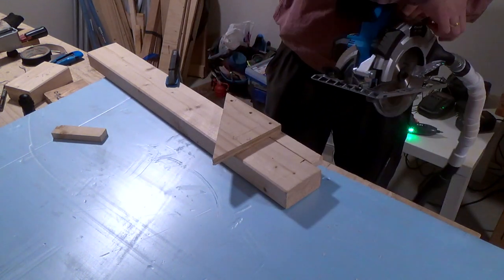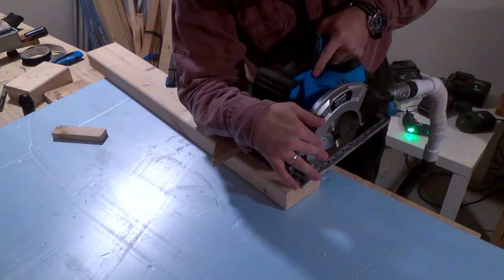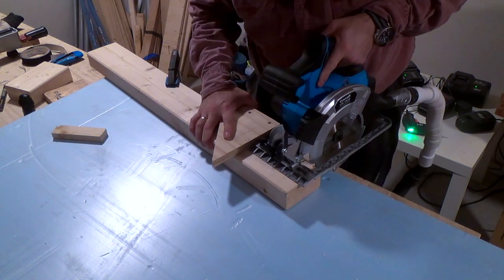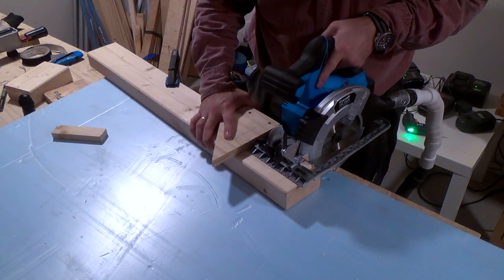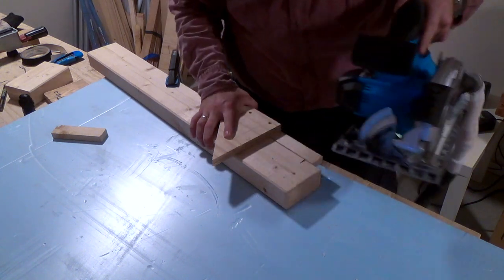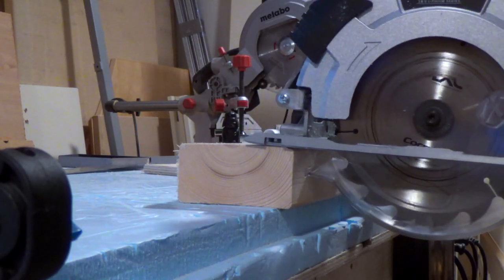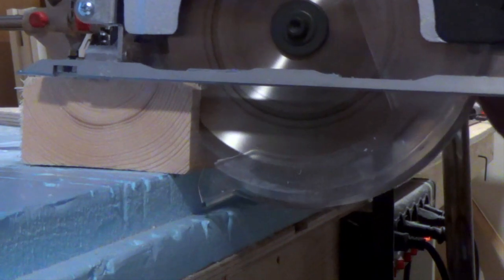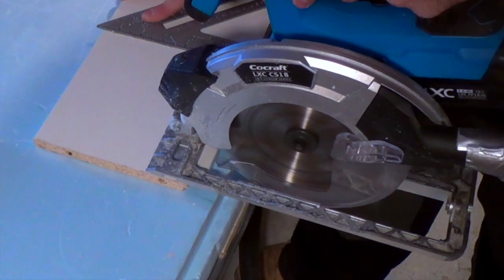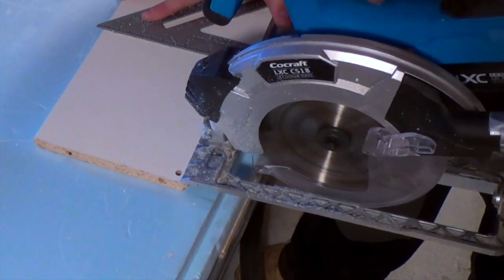Now this is the point where I started having trouble with this saw, and especially with the blade guard. The saw is a cheap one and the blade guard is a rickety piece of plastic. What I cannot live with is the fact that it snags — the bevel in front of the blade guard is too shallow, so the blade guard snags on the workpiece. Also, the lip formed by the bevel on the blade guard protrudes too much, meaning it snags on the board you are working on top of as well.